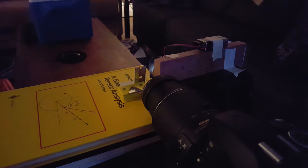Hey everyone, in this video I'm going to go over a topic that I didn't completely cover in my other Schlieren video — this is about where to put the knife edge and how to know that it's at the focus and not too far forward or too far backwards. I have my system set up the way I normally do, with my camera, the knife edge, then the light source, and then the mirrors up over there. This is what it looks like without the knife edge in.